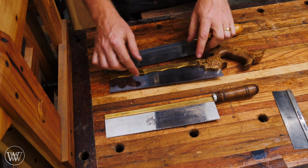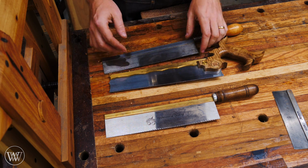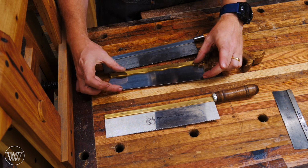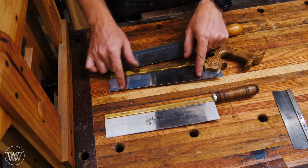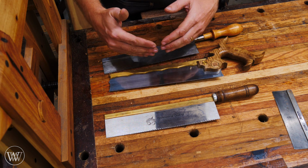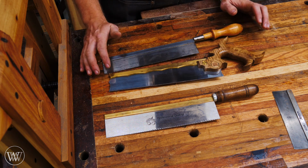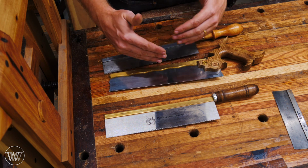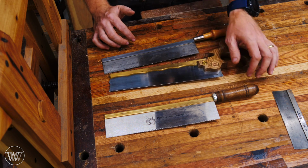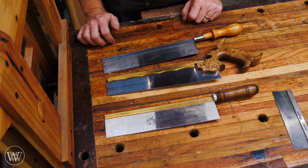They tend to have a back, so you have a thinner plate. And the things that make a dovetail saw is, number one, it's a short plate. In other words, it's not very tall, so there isn't that much space up here. Number two, teeth are very small. Number three, they are on a ripped tooth, or mostly ripped tooth. Some people will put about a 10 degree of fleam in there, just a little bit to clean it up. But they are mostly a ripping tooth, so they're straight in line. They're more like a chisel than a knife. And they're tiny, tiny little teeth, and so that's what makes them difficult to sharpen.